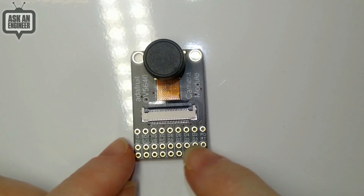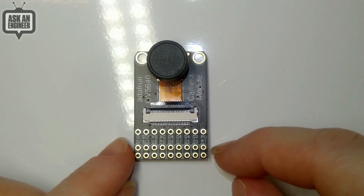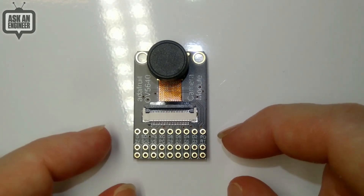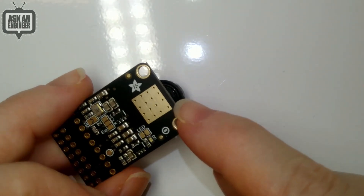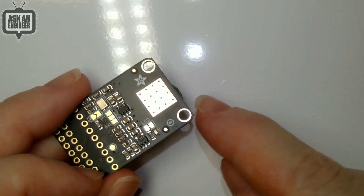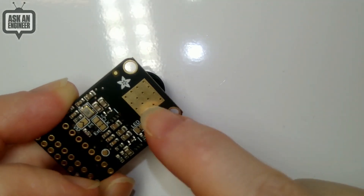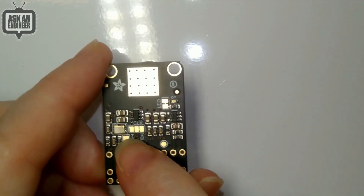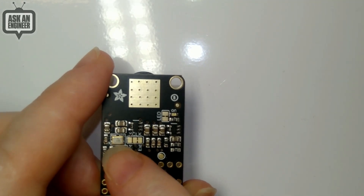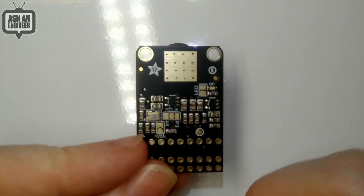Let me go to the overhead and show the improvements. It has the standard 2-by-9 pin header connector, so camera-ready boards can use that connector. I also added a duplicate row 0.3 inches apart which means you can use this in a breadboard. I added a little heat-sinking area — some of these cameras can get pretty warm and it causes image drift, sometimes turning the image purplish or reddish. There's exposed gold copper on the other side for good thermal transfer. I also put a 24-megahertz oscillator on here to generate the clock signal for the X clock pin.